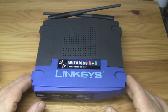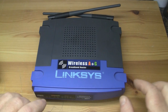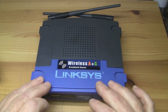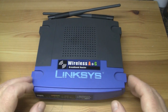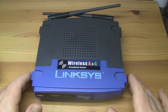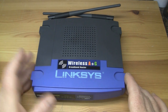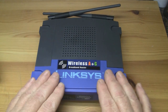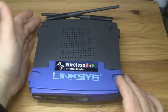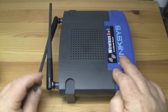One of the reasons I purchased this router is not to use it on my home network — I purchased it to use as a test router. Because it is dual band, I can test my 2.4GHz antennas and my 5GHz antennas. And because there is a lot of space inside here with this classic form factor, I could possibly add an internal battery pack and have a charging port on the side to make it a single unit.